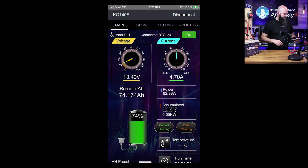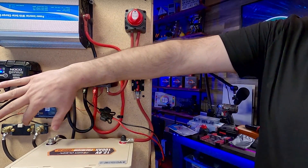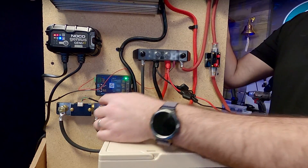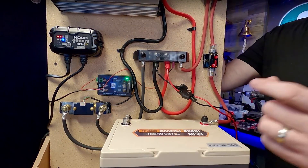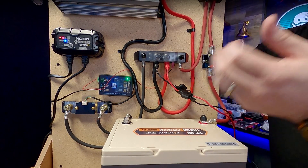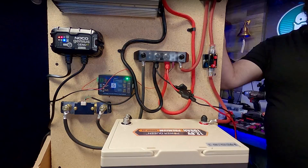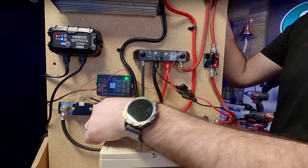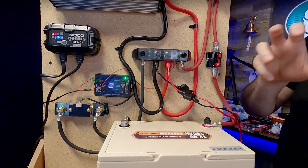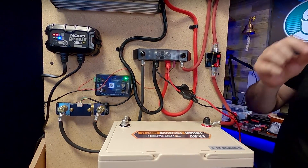We need some way of knowing what our battery level is. This down here is a power monitoring shunt — the power distribution shunt — and it allows you to figure out where current energy is flowing in or out of your battery. On the back side there's specialized metal, and these pieces of metal have a very well known resistance.